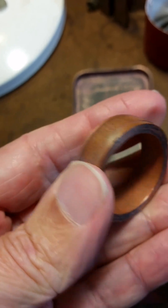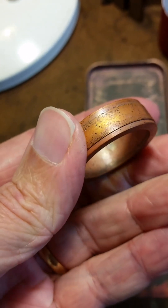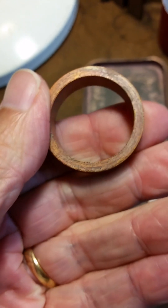This is a copper fire hole ring, an off-cut from the piece I bought in for the quarry Hunslet. It's been step turned on both ends and then annealed.